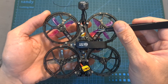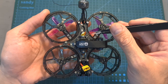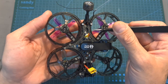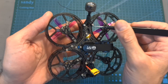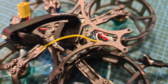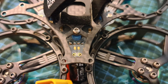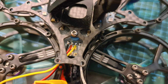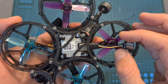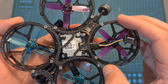For setting up the Micron, if you're not going to use the TBS radio controller, to add an external radio receiver you will need to first remove the top carbon fiber plate, which is secured using 1.5mm hex screws. Then de-solder the yellow SBUS wire from both the Caddx Vista and the flight controller, then solder your receiver to UART1 which is located on the front of the flight controller. After removing the propellers, use the provided USB Type-C adapter to activate the Caddx Vista and update it to the latest available version.